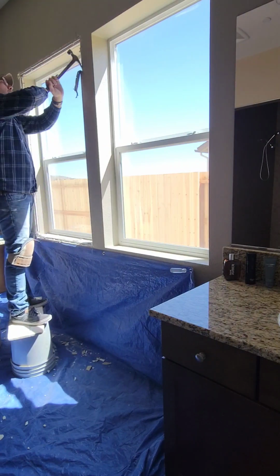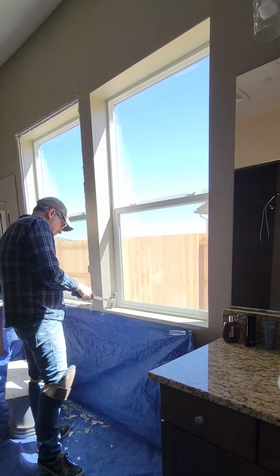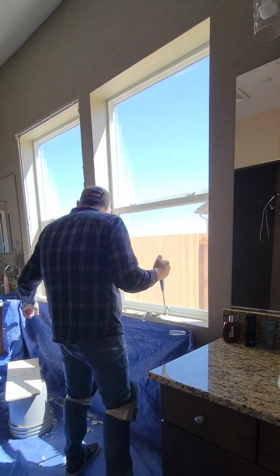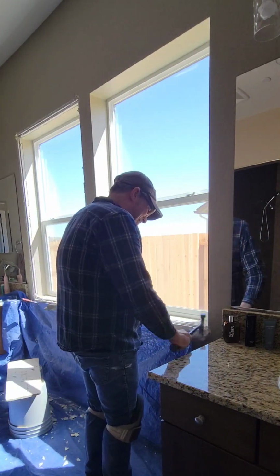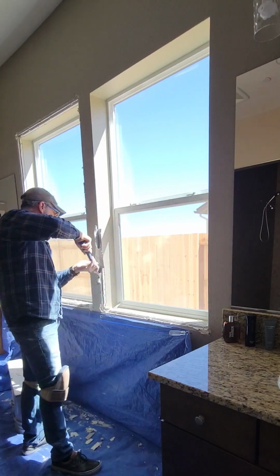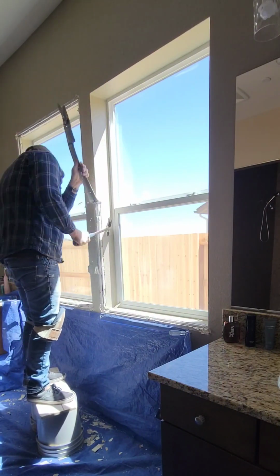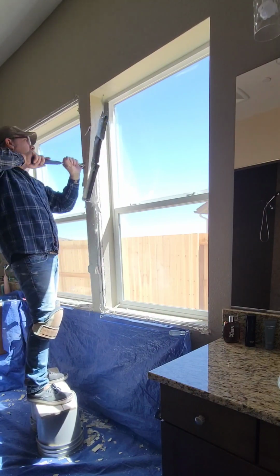The corners are pretty good. There's some gaps in there that I could get the hook of the hammer put in. That's a new run, so getting it initially started, I'm going to have to beat in, get underneath the corner bead. There's some nails that get hooked in the corners. There you can see where I'm hooking up at the bottom again. And this is kind of a good way you could peel it back and then get your hammer hooked under there to pry away. There were some staples and nails.